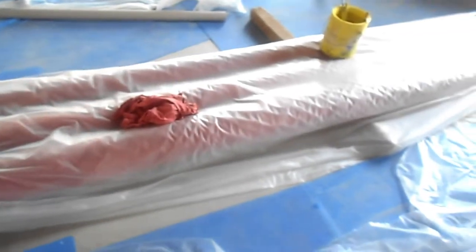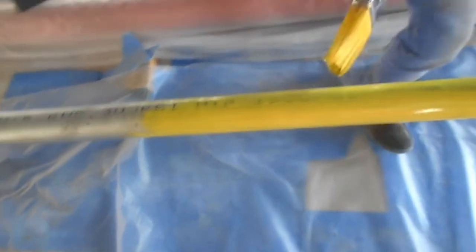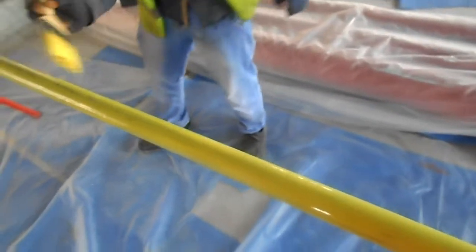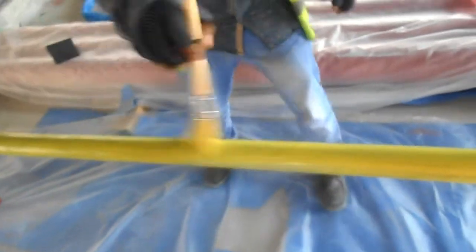After this first coat paint, we will keep it two hours to dry, then apply another coat. As per the consultant's specification, we have two primer coats and two red paint applications. So this first coat we are applying now is the first of the two primer coats. We will cover it with plastic sheeting while it dries.